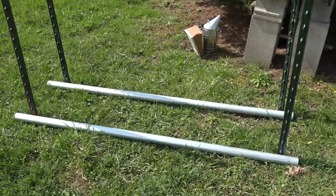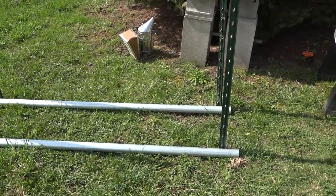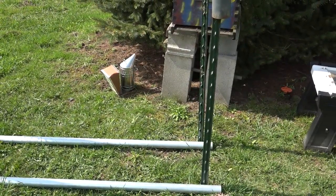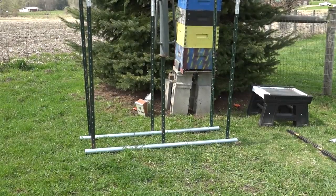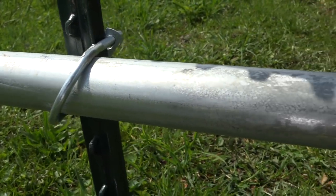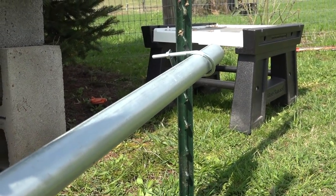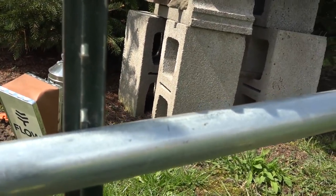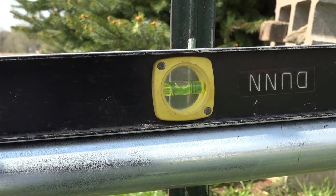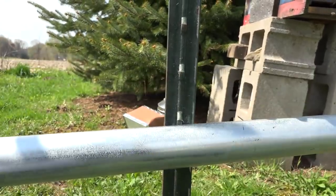Once you've got everything hooked up, if things are a little off level you can tamp one down a little more to level it up. The conduit pieces are five feet each, and I've got the bars and T-posts spaced about 18 inches parallel. All six are in now — it's time to bolt them up, one side at a time. Once you bolt the opposing ends and level those up, I like to leave the middle bolt off yet so I have a smooth surface to lay the level on and make sure we're true before we continue. And we are perfectly level throughout the length of the pipe — then we add the middle U-bolt.